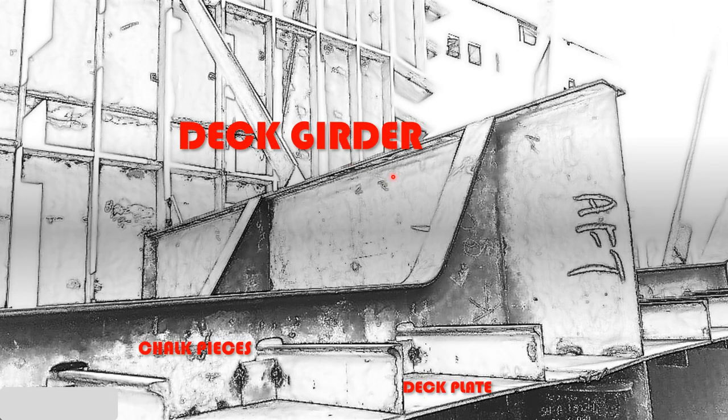Again you can see the block is constructed in an inverted manner, and this is the front view of the block. That is the T girder, that is the deck beam, that is the stiffener, and this is the deck plate. First of all, the deck plate will be placed over the block template, and after that the T girder will be welded longitudinally along the ship block. After placing the T girder, the stiffeners will be welded longitudinally, and after the stiffeners the deck beam will be welded transversely, and these transverse frames will be placed longitudinally as well.